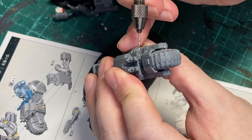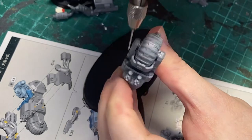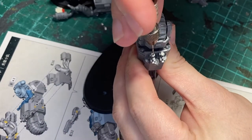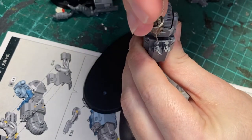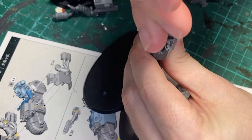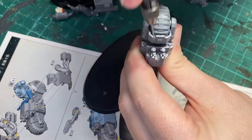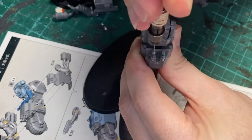I've seen that this is off centre and I need to bring it over to here. So what I'm going to do is with the drill bit I'm going to very gently angle it very slightly, and then use that drill bit to what they call ream out on the side which I need to make the barrel wider on.